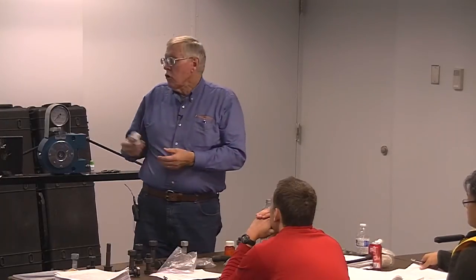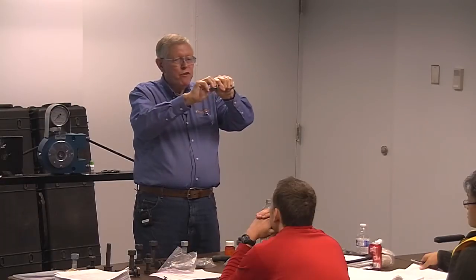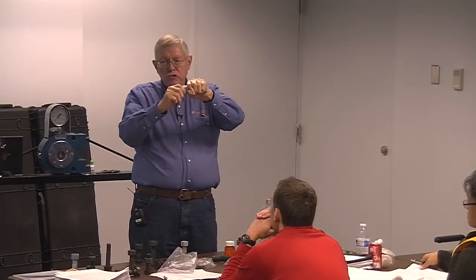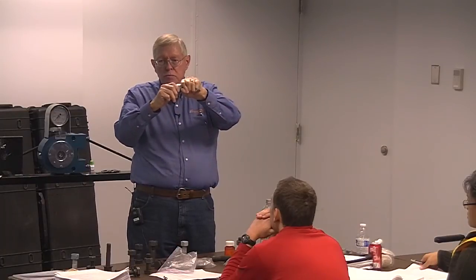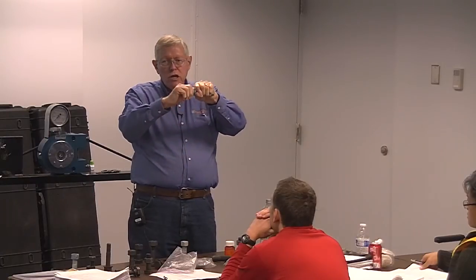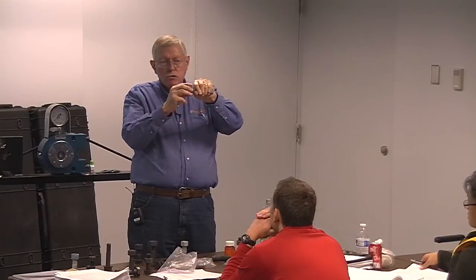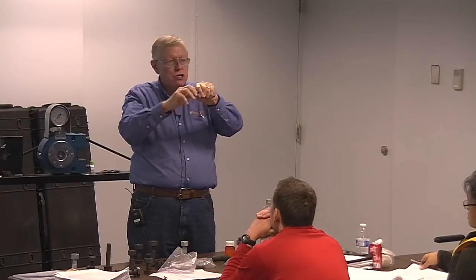Now when you do that, looking at the friction and what it takes to drive that nut or drive that fastener. Okay, I'm turning it this way. I'm going up to 50 kips, roughly where you get your turn of the nut tighter. You compress your DTI. That's around 50, 51 kips to compress the DTI. If I'm doing this and the DTI is over here, it takes about 350, 400 foot-pounds of torque. Let's say 400 foot-pounds of torque to get this.